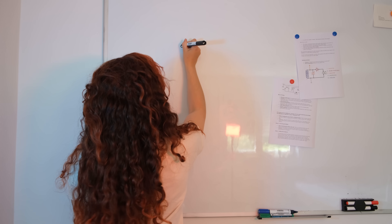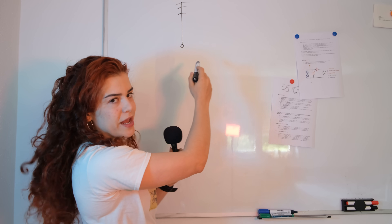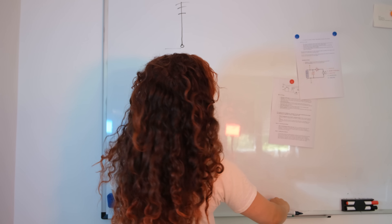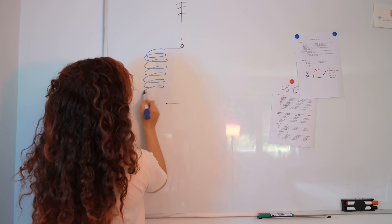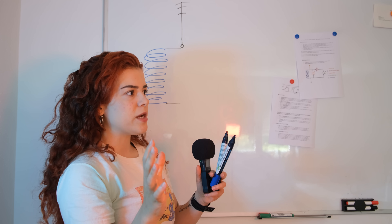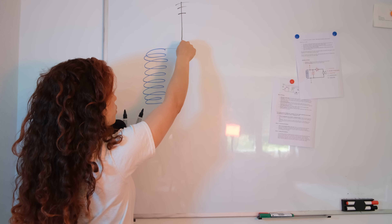So we're going to start with where the radio waves are coming from — they're coming from our antenna. When we're out in the world, there are radio waves all around. Our antenna is basically just there to catch these waves in the form of electrons and bring them into our circuit, which is called the inductor. It's called that because it does one thing called induction. And together with a capacitor, it builds a small network that is basically there to filter out the radio waves that we want to hear, while at the same time strengthening the radio waves, because when they are coming in, they are way too weak.